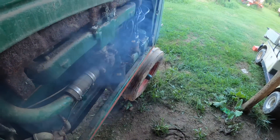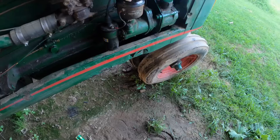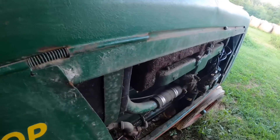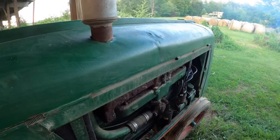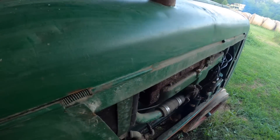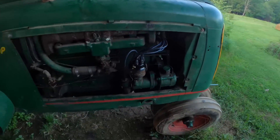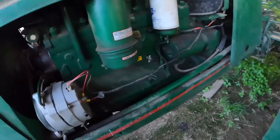Probably would be good if I hooked up these battery cables. All right, neutral. You know what would help — turning the gas on. Turning on the gas would probably make it run. All right, now — I think that does run a lot better. Still not perfect. We need to fix our exhaust leak and we need to mess with our governor, because I do not believe that we have very much governor action at all.